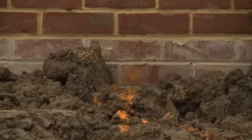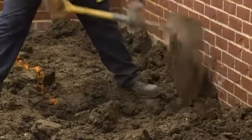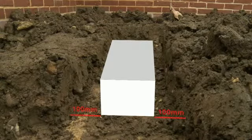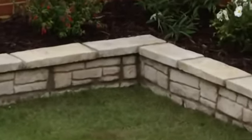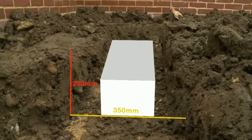Foundations, or footings as they're sometimes called, aren't always necessary with a small wall that is less than 600mm high. If you have an existing concrete base or an area of firm and stable paving, you could build straight onto that. But because our planter is going into an area of garden, we'll need to form a simple strip footing using concrete. The size of the footing is determined by the walling blocks — you need around 100mm of working room, or spread, to each side. Because the Old Town blocks are 150mm wide, the footing will need to be 350mm or so in width. Our finished wall is only going to be 450mm high, so we don't need a tremendously deep footing — between 100 and 150mm will be plenty. We also need to start laying the walling blocks a little below ground level, say 50mm, so the footing won't be visible when the wall is finished. This means we need a trench 200mm deep and 350mm wide.